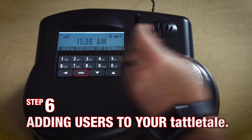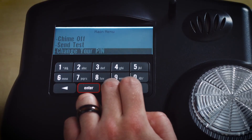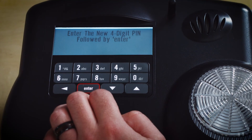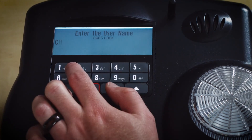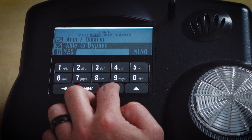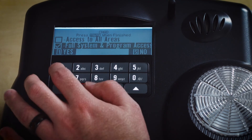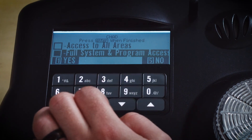When you want to add a new user to your system, begin by pressing 5 for more on your base unit, enter your PIN, scroll down to Setup, then to Users, then Add. Enter a PIN that will be associated with that new user. You can then create a name for that user using the numerical keypad to select the letters. After pressing Enter, you can determine which permissions you want to grant that user. By default, a secondary user only has permission to arm and disarm and bypass zones. If you want to grant the user additional permissions, select that permission and press 1 for yes. Likewise, if you want to remove a permission for a user, select that permission and press 5 for no.